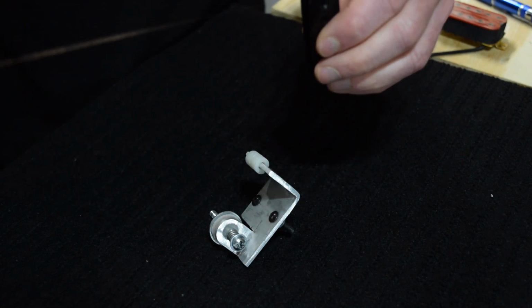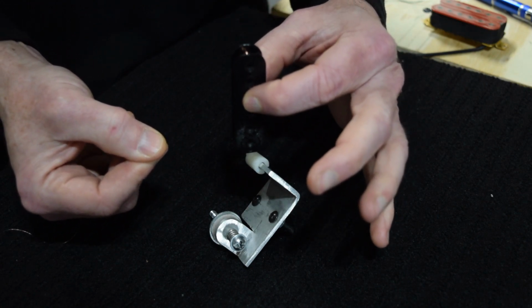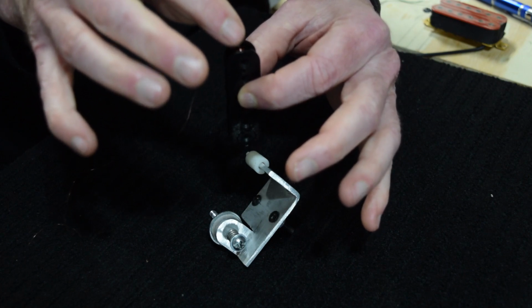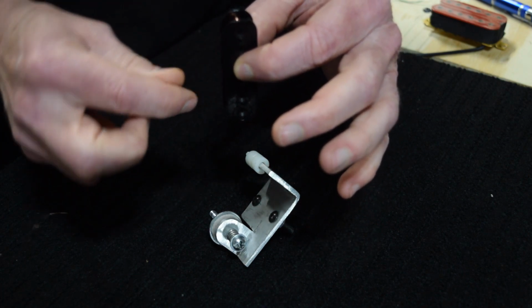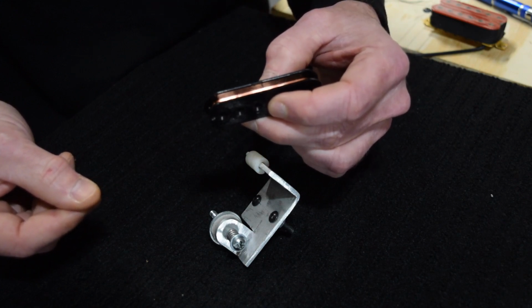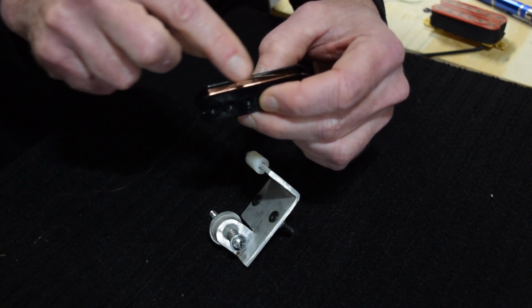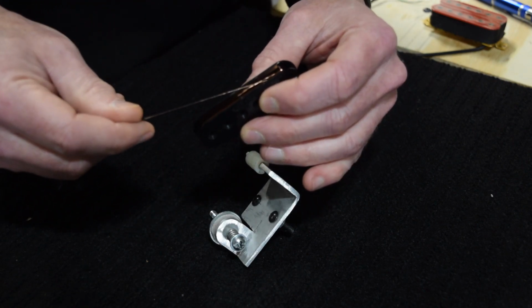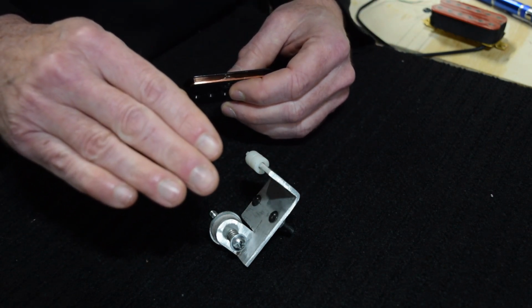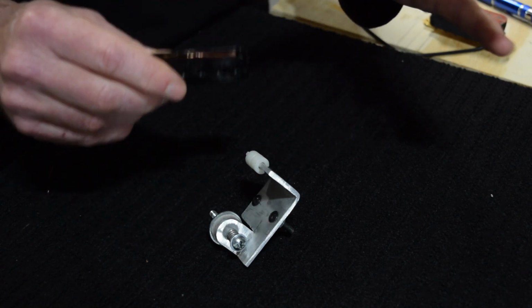So as the bobbin is spinning, in this position, for example, there's going to be more tension at the top edges than there is at the side, obviously. And then as it turns, the tension increases at this end, and there's less tension in the center. So as the bobbin is winding, the tension is constantly bouncing up and down through the entire process.